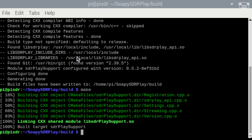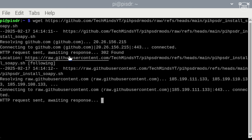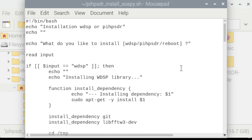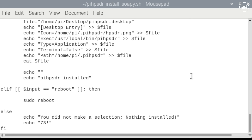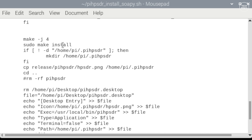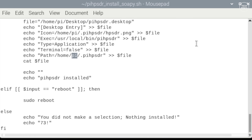Now download the Pi HPSDR install script from my GitHub page. This script is based on one I found online but with some small modifications — specifically it ensures that Soapy support is activated in the Pi HPSDR makefile. Once downloaded you can browse the script. Remember at the start of the video I said the username should be set to 'pi' — that's because the script expects a folder called 'pi'. If your Pi OS has a different username, search for 'home/pi' in the script and rename it to your username.